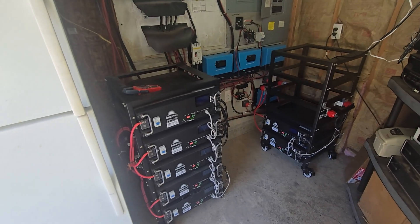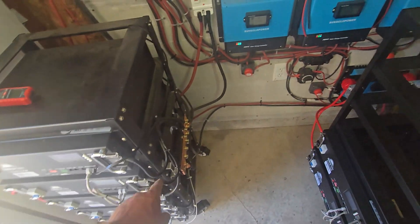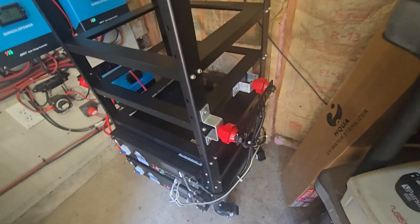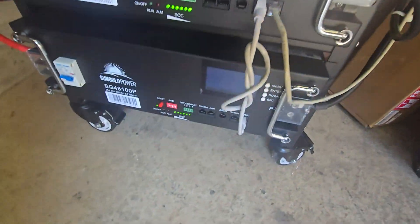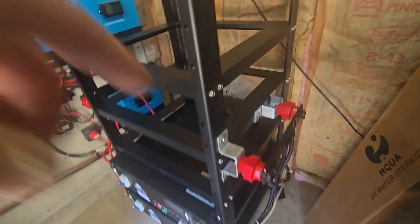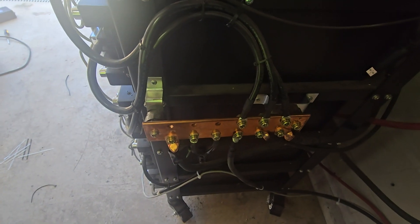Final steps are done. Got our bigger gauge wire running over here, tying into the bus bars, which go over and tie into the bus bars I installed on the side. So if I want more capacity, I can add three more batteries to this side. They are up and running and talking. My Cat 5 runs across to the other unit. I taped up the copper bus bars because they didn't come with covers, so I just used black tape — hooked everything up and taped them so they're not exposed.